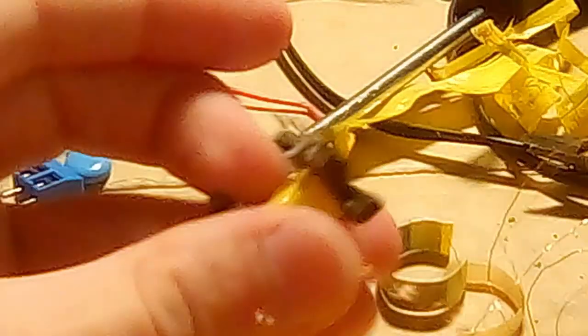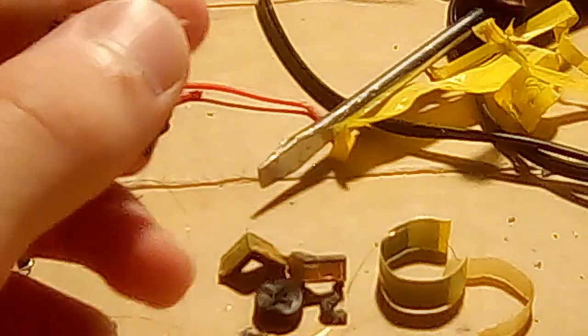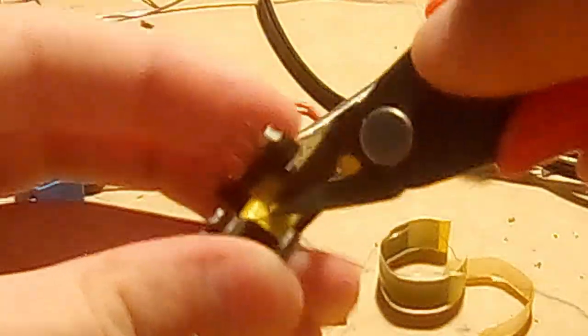Okay, that looks like primary. Looks like one of its sleeves is insulated. That's interesting. I'm not sure, because there's another layer of insulating tape under this. Maybe there's another turn of primary. Let's rewind this off camera. 105, 106, 107, 108, 109, 110, 111, 112, 113, 114, 115, 116, 117, 118, 119, 120. So that's what appears to be just one section of the primary, and now it goes straight into another section of the primary, insulated with yet more insulating tape. This is a big primary.